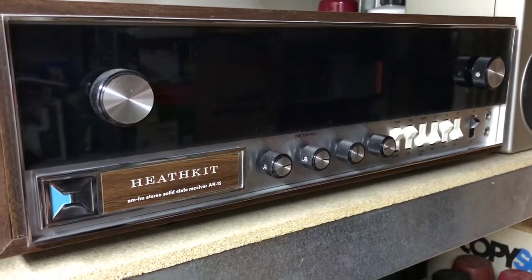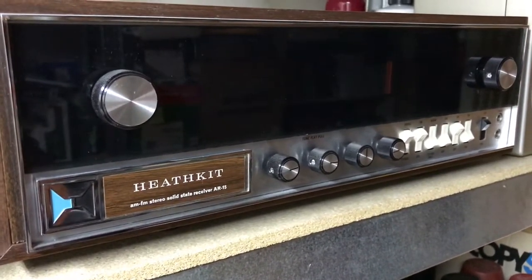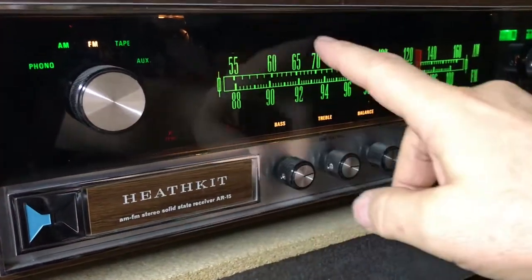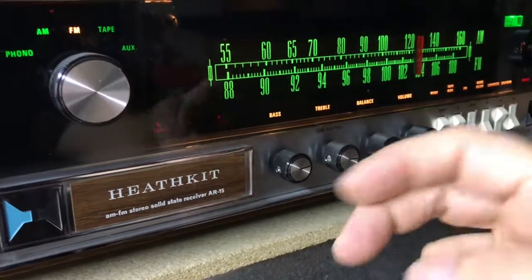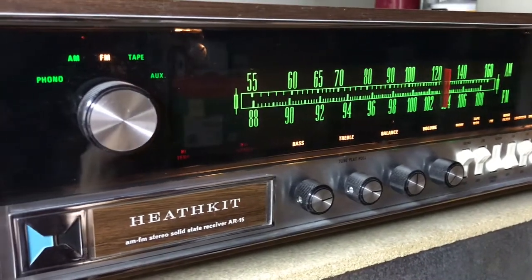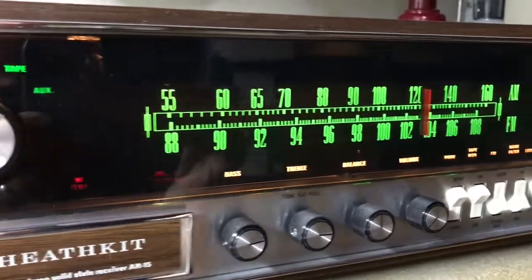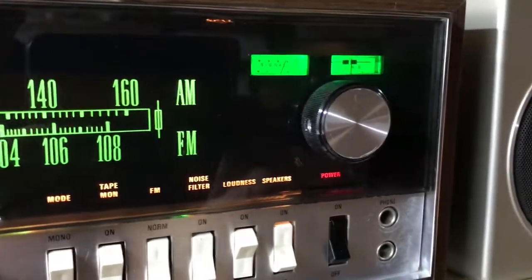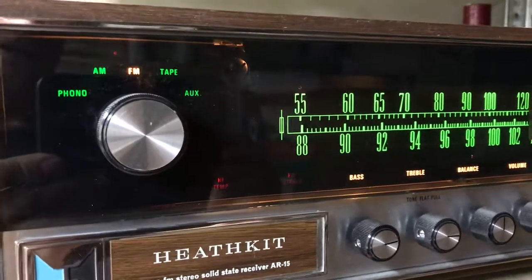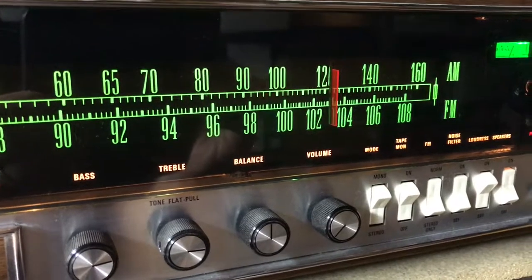Just one other thing I wanted to point out: having gone through a restoration on a number of these style units, one of the things I think is absolutely critical in making these things look good is to work on the back plate that has all the graphics on it — coming in from behind and touching up all of the black scratches that would otherwise let a lot of light through. It makes for a great presentation once you've done that, and the dial then shows just black and comes across very nice. That's something when you've got these things apart that you always want to look at, because it makes a huge difference in terms of clarity and overall appearance.